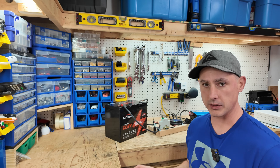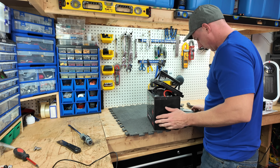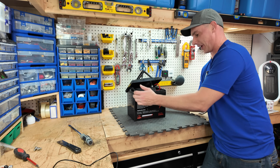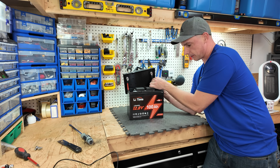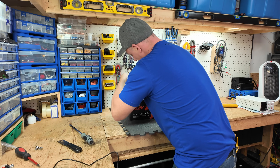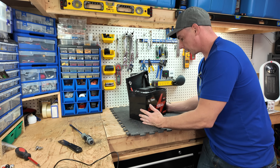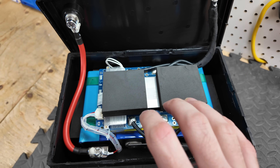Let's see the build quality and hopefully get an idea of what type of cells they're using. The battery is now open — note it does say do not disassemble. Right off the bat you can see we have hydraulically crimped lugs. This feels like three number 10 wires and then a single number 6 conductor. So we have three number 10 conductors and a number 6 conductor. Inside the battery we have a couple pieces of foam pushed against the lid to keep everything in place.